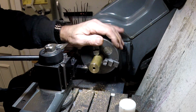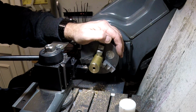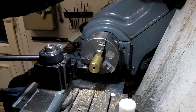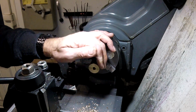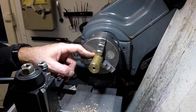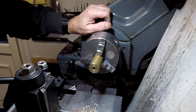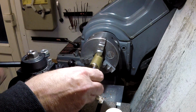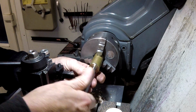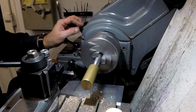You'll have to turn this down no matter what, because there's a little bit of a mark there, which I did with a hacksaw, cutting this off. To turn it down, but let's go it onto the mandrel and gently do it. It's putting a centre in though, doesn't it, in the other end, otherwise I'm going to bend it. That mandrel's not going to be strong enough, I wouldn't have thought, to support me turning it down. Yeah, it's too wobbly anyway, it's going to need turning down